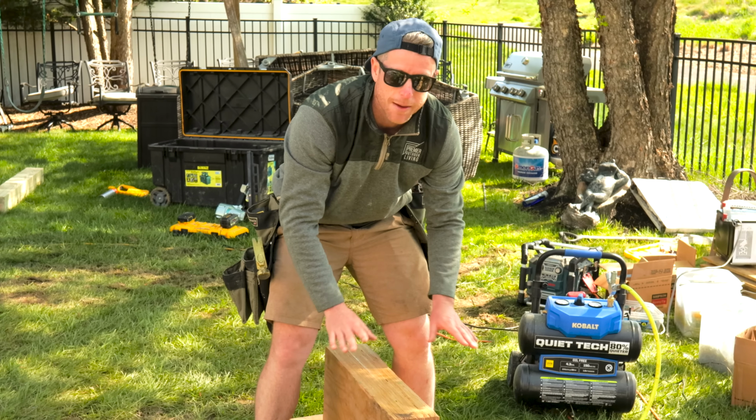Take this bad boy out. When can we take this out? After sheathing? Okay. The sheathing on this is pretty important because the architect explained it as essentially once you sheathe this, it creates a diaphragm and that load is being spread over a wider area. So it kind of eliminates a little bit of this point load, and then by cantilevering this across, typically we wouldn't have an LVL across the front, but that is gonna help kind of take some of our load.